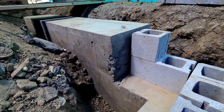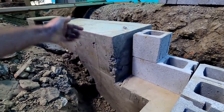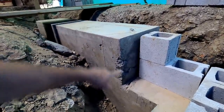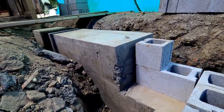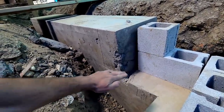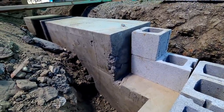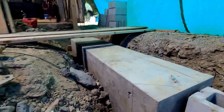It's where they had to pump the thicker concrete in the steps, in order to get it to stand up and not just run out. A lot of people that hadn't dealt with concrete and steps before couldn't hardly grasp how this concrete was going to not just flow out, because concrete doesn't flow like water. In fact, the bottom of this step, where I've got a void there, ended at the very top of the lower run here. So kind of counterintuitive, I guess, if you think of it similar to water, but concrete doesn't act like that. So you can see, it looks pretty good.